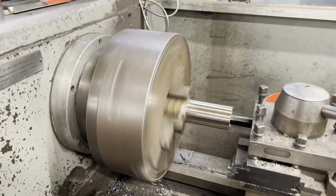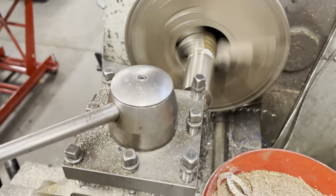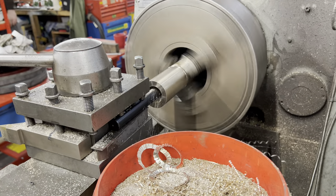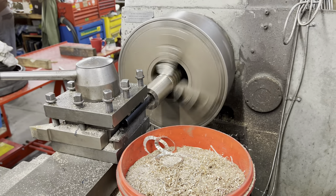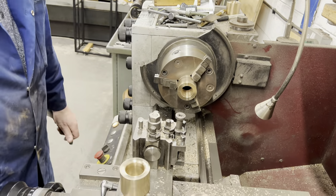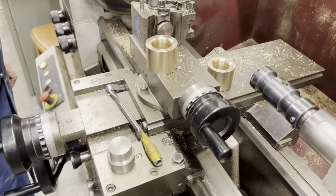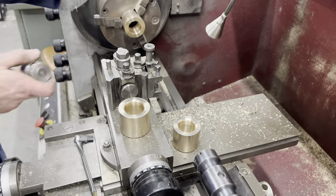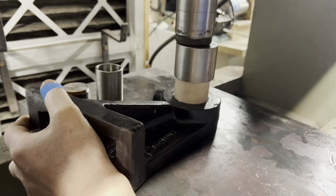You can see the bearing itself — the thin double line around the centre of that shaft — and this is the new bearings being made. This is phosphor bronze being machined on the lathe by Neil. We're making that bearing to go into the expansion link bracket and hold the pivot pin for the centre of the expansion link to rock in. Neil is using a dummy template made to the right size for the pin on the expansion link just to check it fits, and a couple of them are already finished with a slight radius, as per the drawing.